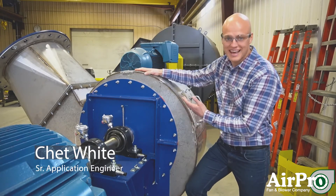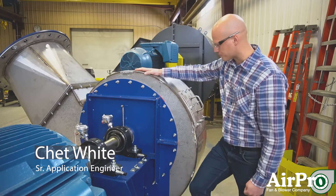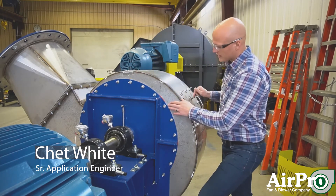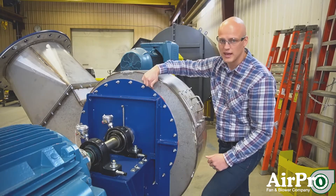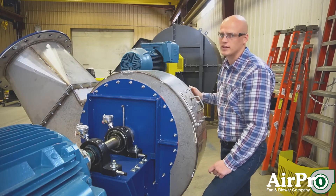When we're manufacturing a fan for gas-tight construction, there are four areas we want to talk about. The first is your connection points. On this particular fan, you've got a connection point, a drive cover plate, and a housing right here. You have to have adequate gasket — this is mirrored on the other side of the fan, so you have to have adequate gasket between the inlet cover plate and the housing.